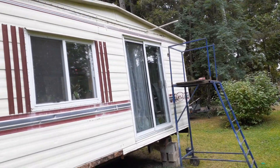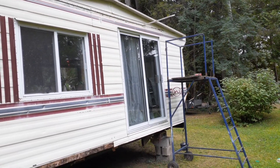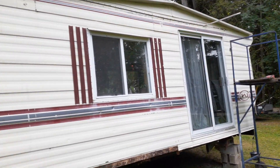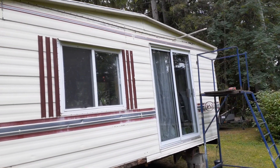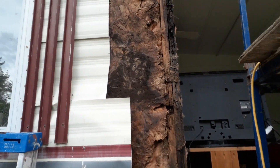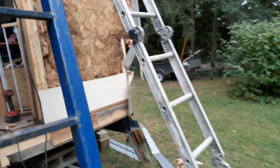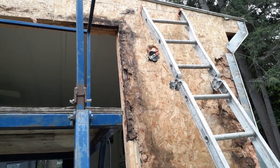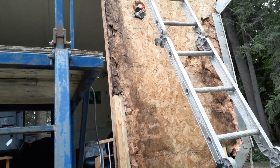So I'm taking on the biggest challenge yet. I intend to take all the tin off, remove the insulation between the studs, plastic in a form, and fill it with styro aircrete — through the whole entire trailer on both sides, working one section at a time. The left side is in very rough shape, but there are 2x3s in there and I'm going to switch those to 2x4s at the top as well. On this side there's quite a bit of repair already done, with a couple of half studs that I'll replace with 2x4, and then I'll add an inch and a half to the other stud so I end up with a full 2x4-width cavity to fill with styro aircrete.